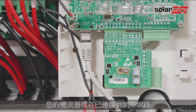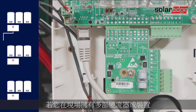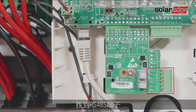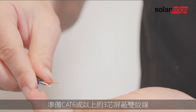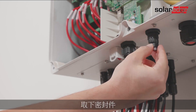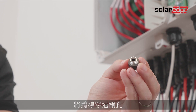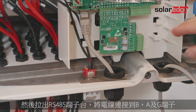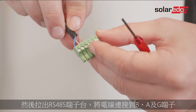Close communication gland one and plug the other side of the ethernet cable into the ethernet router — your inverter is now connected to the internet. If you have multiple inverters or devices on site, you need to set the RS485 connection to enable site communications. Locate the RS485 terminals, then prepare a Cat6 or above three-wire shielded twisted pair cable. Open communication gland two, remove the seal and one of the white plugs, insert the cable through the opening, then insert the seal with the cable back into communication gland two. Pull out the RS485 terminal block and insert the cable wires into the B, A, and G terminals.